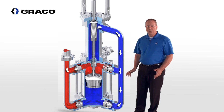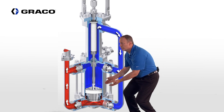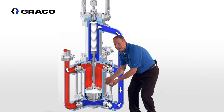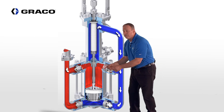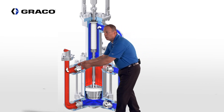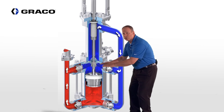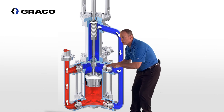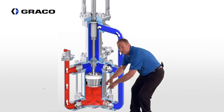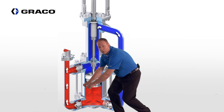Let's talk about the operation of this pump. As the piston is moving up, it creates a low-pressure zone beneath it, allowing fluid to fill that cavity. Above the piston, any fluid will be pressurized and pushed out the outlet check. On the downstroke, we're going to be loading fluid from this check to fill the cavity, and the fluid loaded in the upstroke is now going to be pushed out the outlet.